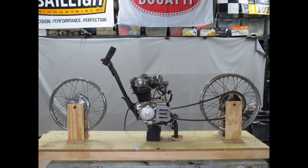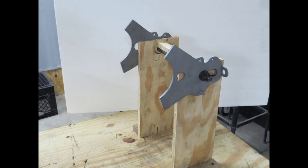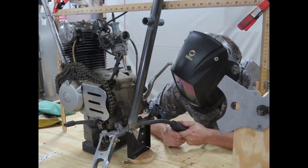You see the rear axle plates mounted in the jig. The little tab sticking out perpendicularly from the plate is for the chain adjuster. The axle is clamping the plates to the wood itself, and I was able to fine tune them with this method — it worked really well. I did TIG welding on about 90 to 95% of this bike. I did do a little MIG welding, but only MIG tacks. After the MIG tacks I'd take it to my workbench and do the final welding in TIG. Here I am MIG tacking the fabricated down tube to the back.